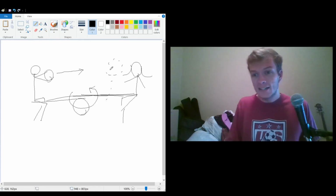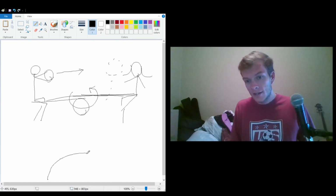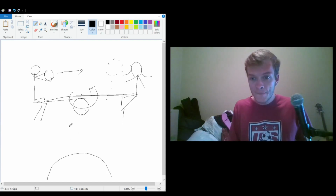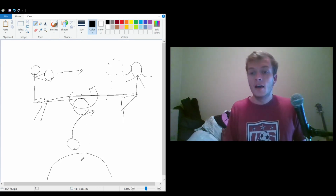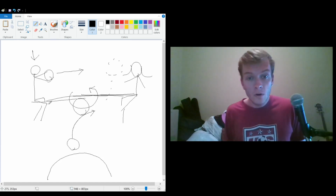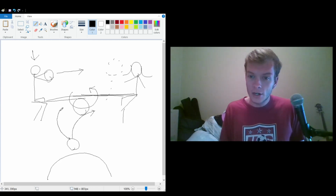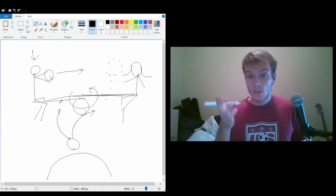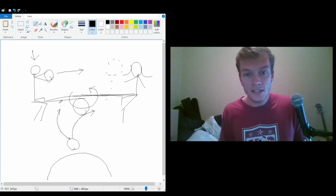So in terms of Johnny's perspective, we're going to look down Johnny's line of sight to where Sally was. It seems as though this ball is taking this curled path out to the side because he is in a rotating reference frame. You can try this on your own. You will get somewhat dizzy, and what you essentially have to do is throw the ball here so that it curves to where Sally will be. So this Coriolis acceleration is there, but it only exists in a rotating reference frame.